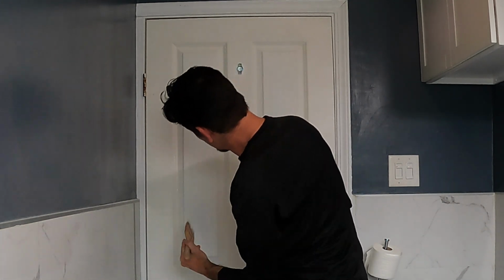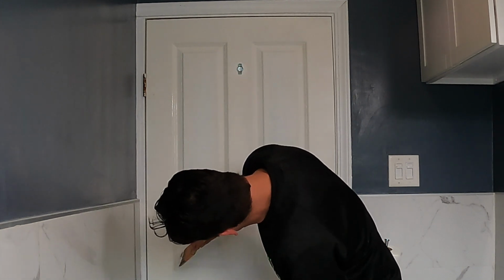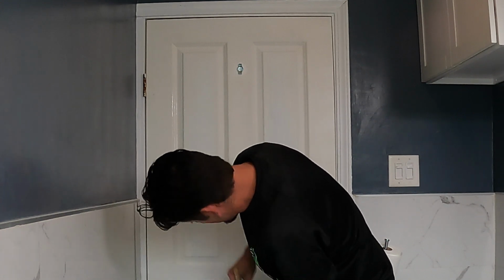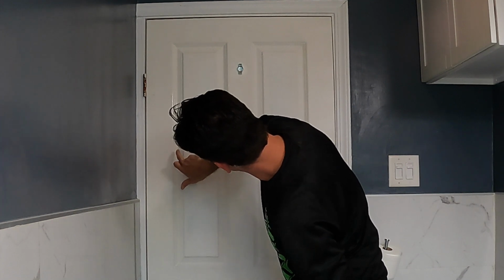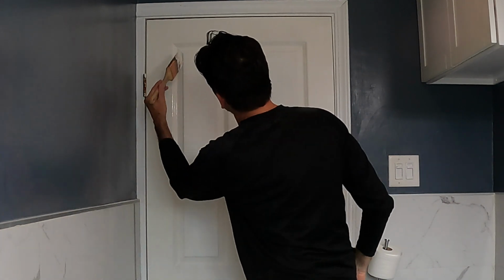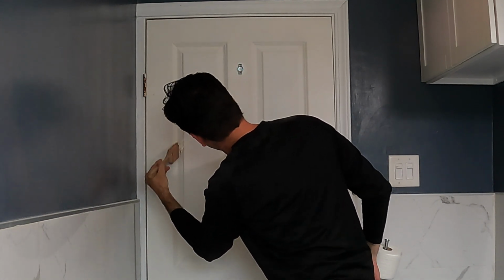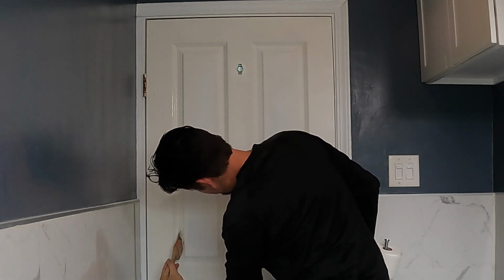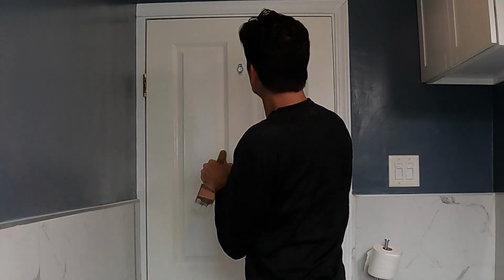So I got to get back to it before the paint I've been putting on sets up. I'm just right here, right? So we're cutting in that side. We're also kind of cutting in this side. We don't want the same thing. We don't want it to come here quite yet. That's going to be last. And it was a little slow just a second ago when I was showing you guys the way to do it, but that's okay. And then we just lay it off.